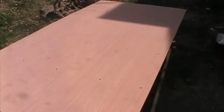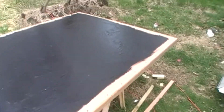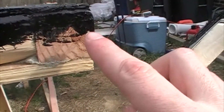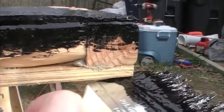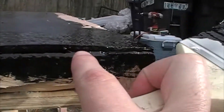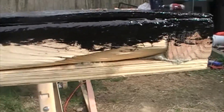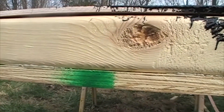We'll be back here and I'll show you how to coat the bottom side. Wait four to six hours for that to dry before you put on the next coating of roofing tar. First thing you want to do is go around and seal all the middle once everything dries — that way all you have to do is go around and do the edge all at once. When you're doing the edge, you want to make sure you don't get the tar all the way down on the bottom side; you're going to have to run a bead of sealant or glue just like we did on the rest of the stuff on this side. So just get down as far as you can and try to get that seam sealed up with tar as much as possible, so it's good and waterproof. There's glue inside so it's not too critical, but you do want to make sure you get a good coating and coat all the edge — the whole bottom side of the luan side, not the half-inch plywood side, the luan side.